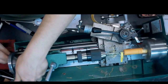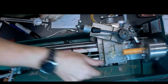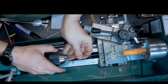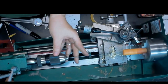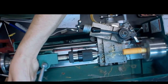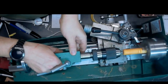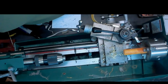Again, you can feel it meet up on the other side. So this is a long 1/16 inch bit, and the nice thing about this is it's flexible. It will center on that tapered end of what we just drilled, and if we're through, it'll just slide through. If we have to give it a few turns to break through on the other side, that's fine, and then we can just slide all the way through and make sure that we've got a complete open airway all the way through the blank. And that's how you drill yourself an airway.